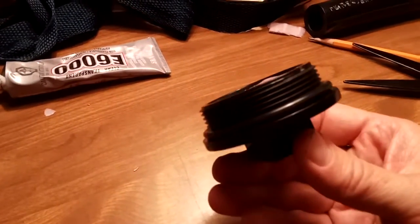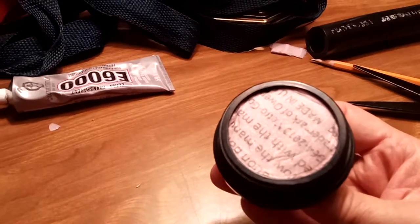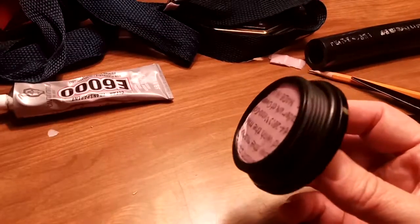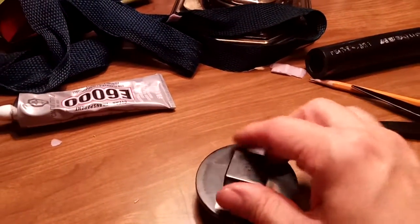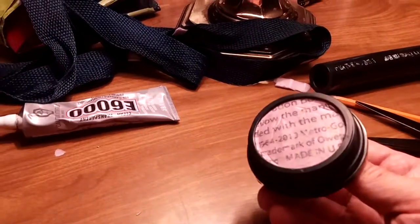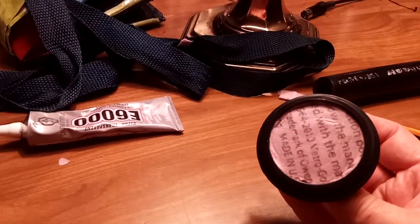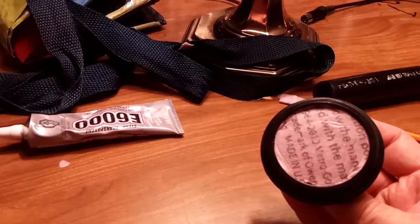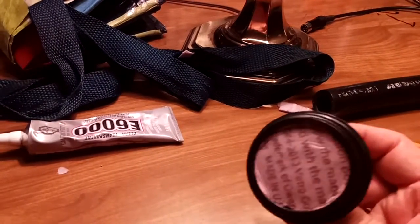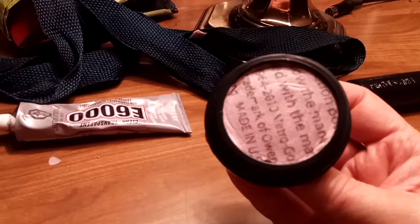When I'm traveling, the solar panels are plugged into the front battery, which I'll rarely use — it'll just be a backup. When I park, this plug will be unscrewed underneath the right bench, and there's a 30-amp plug that will go underneath the trailer through the hole and plug into my new solar generator, which is lithium polymer ion with a built-in inverter.